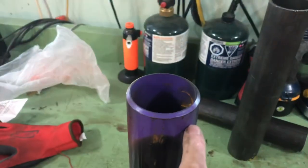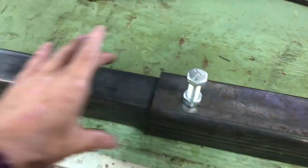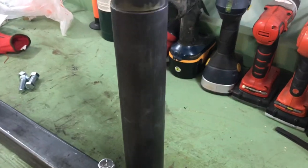This will go over that. This is basically like a two-inch hitch receiver pipe, so this will attach to that — except it'll attach to the top up here. Weld that on there. It'll probably be cut to about that length. I'll be welding a nut on there so I can lock that in position anywhere along the length here for different size rims. This will be welded onto that short piece.